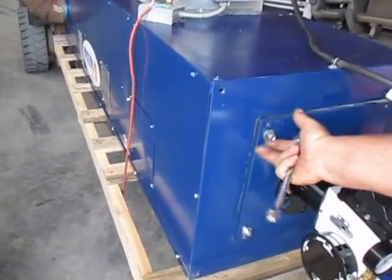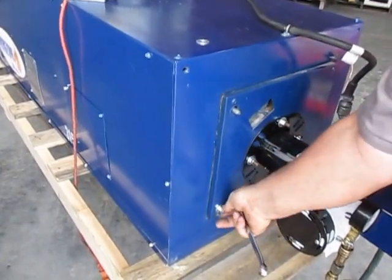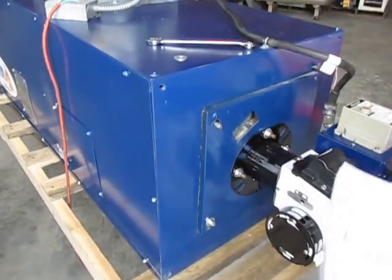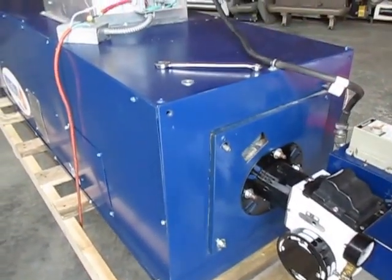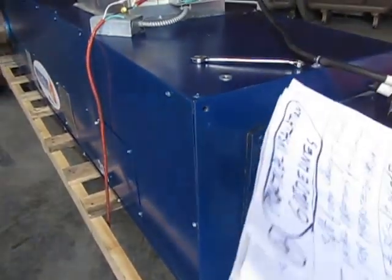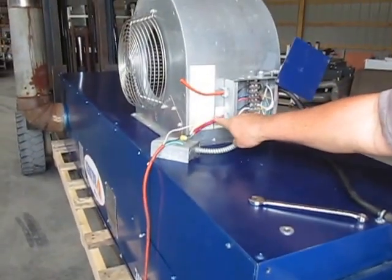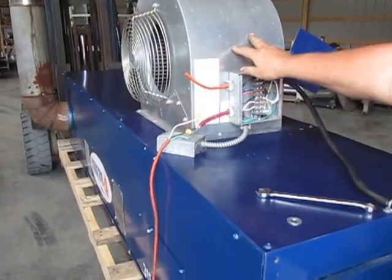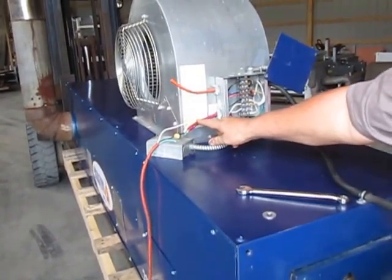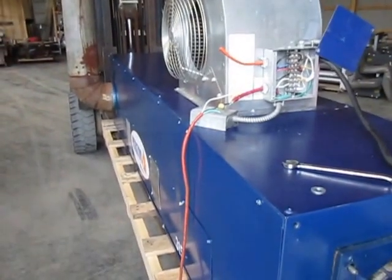The fourth category is practical installation guidelines. You want three feet in all directions around the furnace for fire protection, and it needs to be mounted eight feet up off the floor. Be sure you use a heavy enough power cord — direct drive squirrel cage fans typically use more current. You need at least 12-gauge wire coming in, possibly 10-gauge especially if you're running a long distance or using bigger furnaces, so your wire doesn't get hot.